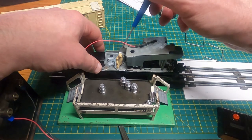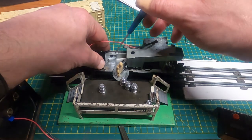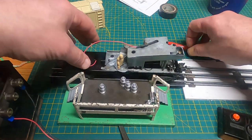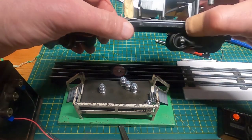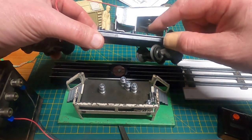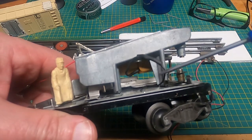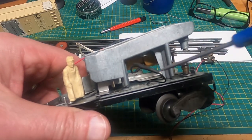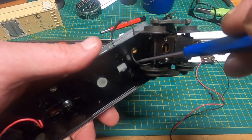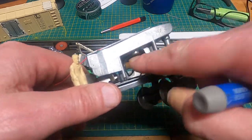Clean this really good with a scratch brush or whatever. Graphite seemed to work okay. I need to make a little bit more adjustments and some of this wiring here needs a little bit of work. I had to re-solder and put some shrink tubing on these wires — these wires are pretty brittle and the insulation kind of cracks off, so you've got to make sure they're insulated well. I actually did put an extra wire on there to go down to the truck. It's worth it to replace it, and the wires are kind of long but there's a reason for that.